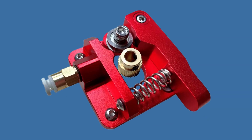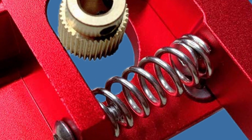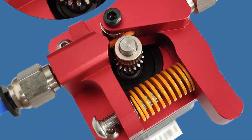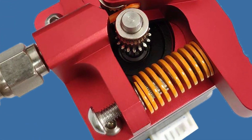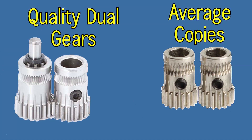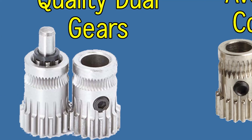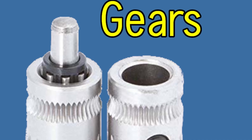The next item in the filament path is the extruder. One big issue that most filament paths have is the spring in the extruder gears. If you get a 3D printer with a single gear extruder, get a set of 3D printer bed springs and use one of them in your extruder. It is important whether the gear that grips the filament is rounded around the filament rather than straight. A straight gear has less surface for gripping the filament, while a chamfered gear has more surface for gripping and leaves fewer scrapes.